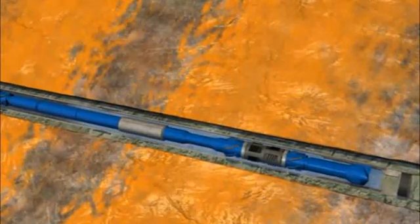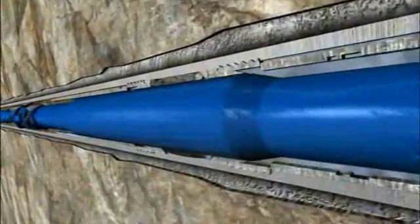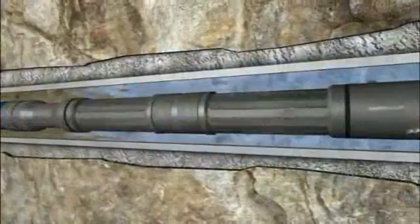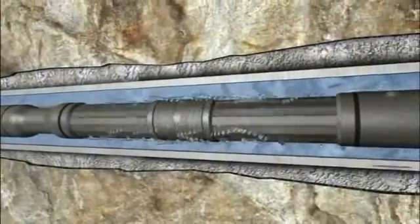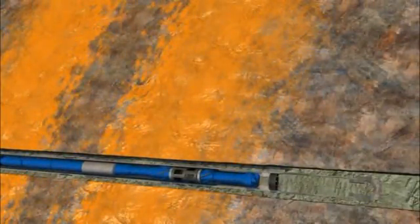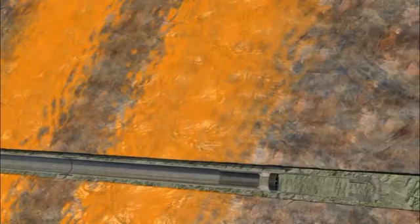After dressing off the liner top, the well is then circulated to remove any cuttings and debris. The drilling mud or contaminated completion fluid is displaced from the well to remove as much debris as possible. As the fluid is circulated through the bottom of the work string, the Grab-It downhole magnets will collect any metal shavings that may have resulted from milling the shoe track. Once the well's original fluid has been displaced, the Smart Intervention wellbore cleanup bottom hole assembly can be pulled out of the hole to capture any residual debris suspended in the fluid in the multitask filter.